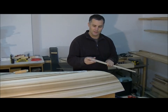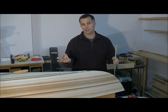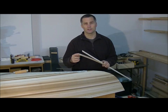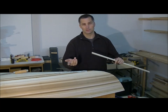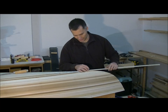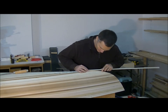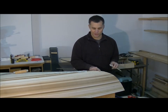Now I have a couple pieces of strips. This is ash stem stock, and usually stem stock is a quarter inch thick. In this case I'm using 1/8th of an inch thick, and they're 3/4 of an inch wide. I can take that and gauge my depth so I know how far deep to go, and also judge the width of my chisel or plane.